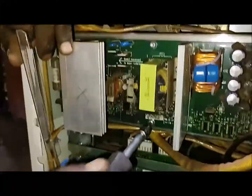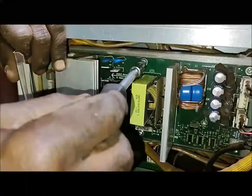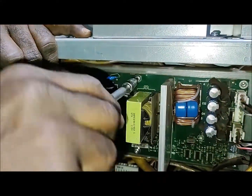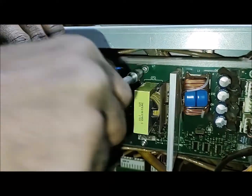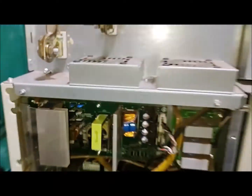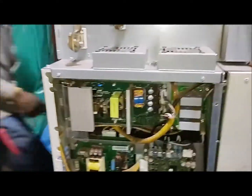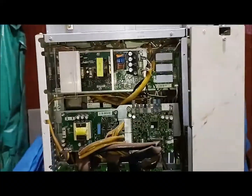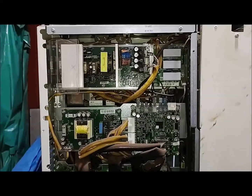Next — the drive cooling fan card, which we have seen in the box on the left side. This particular card is the cooling fan card. There is a cross mark on it, which indicates that this cooling fan card is faulty. The reason it is faulty is what we will observe by turning on the drive.